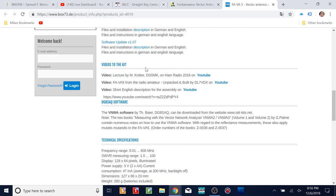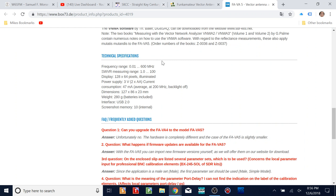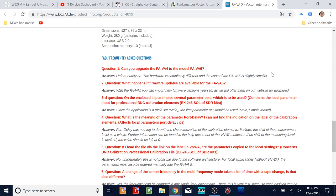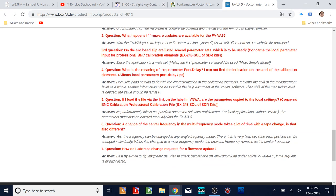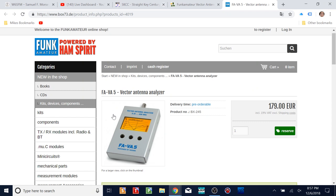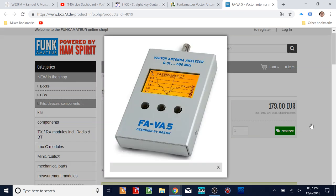And then, so you need to calibrate it to each piece of coax? Every antenna analyzer is exactly that. The instant you put a piece of transmission line on your antenna analyzer, you don't read the true impedance. If you're going to avoid the coax as part of the measurement, if you don't need to read the antenna from the feed point, you don't have to climb your tower and do an OSL for every measurement. See, the SWR only changes relative to how much loss is in the coax. But the actual impedance of your antenna varies with the feed line that's between your analyzer and the antenna. The transmission line is actually a transformer. Every antenna analyzer, every network analyzer, they all have that same issue. You cannot read the true antenna impedance unless it's a perfect resistance, because the transmission line impacts that.